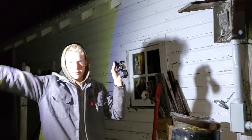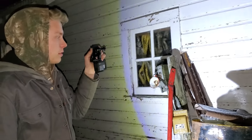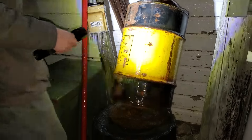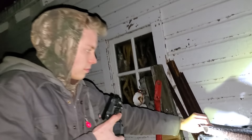We're over here at Ruben's, and earlier I was working on his water heater, but there was only one leg of power. I thought it was because of the energy management program that he's on, but apparently that wasn't the case because he came home and lights were not working.